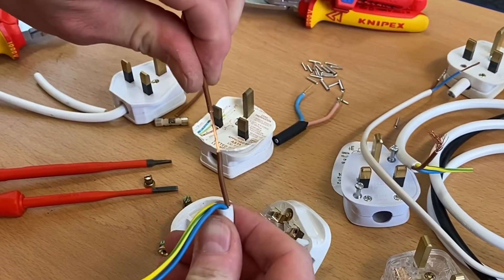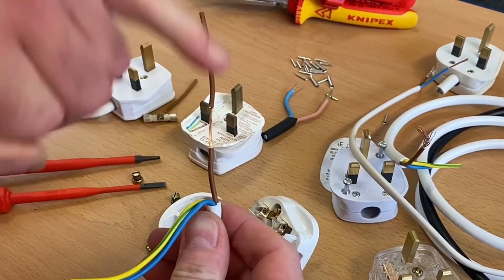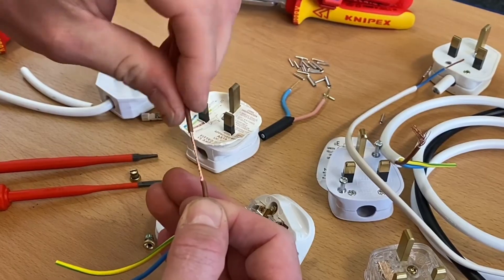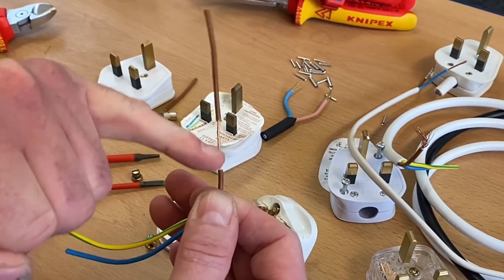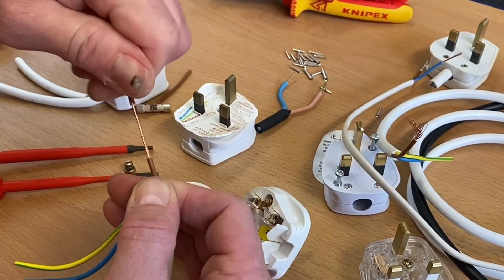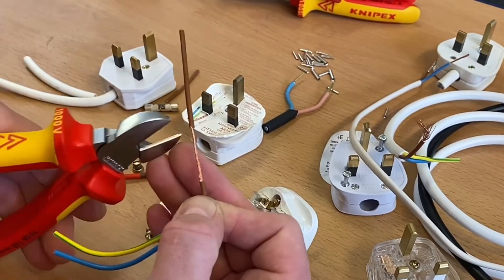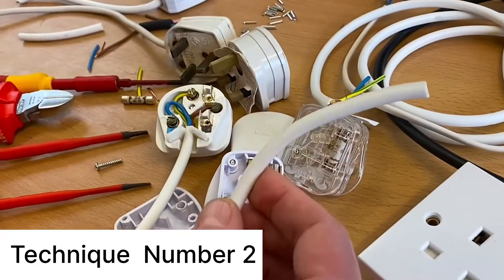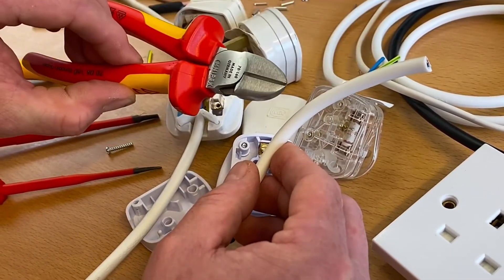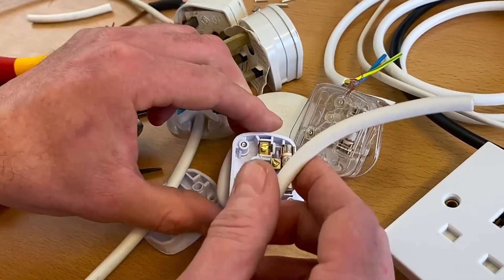What I don't want to see now is all the copper strands coming off. Sometimes students like to leave the last bit on — if you leave the last bit on, you can twist it nice and tight. But none of those strands broke away. It's going to be longer than we need it. Now I'm going to use the method I was trained in — using a pair of side cutters to remove the outer PVC. It's certainly the same principle as before.